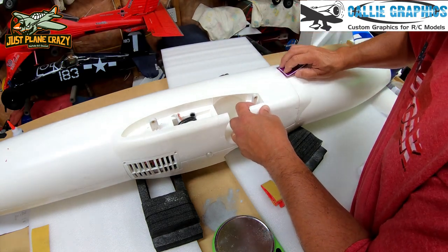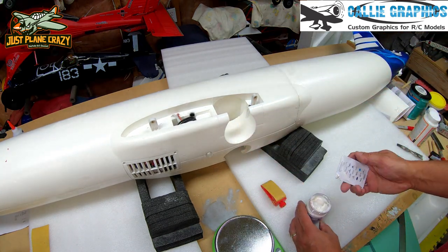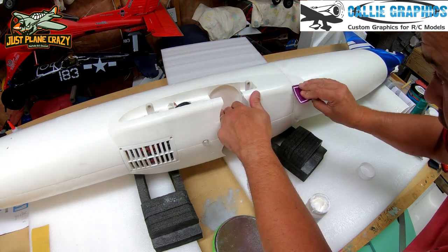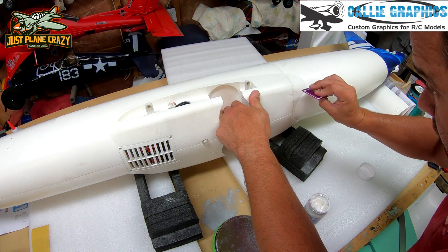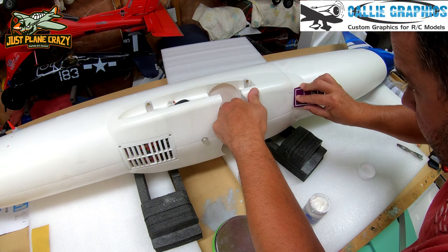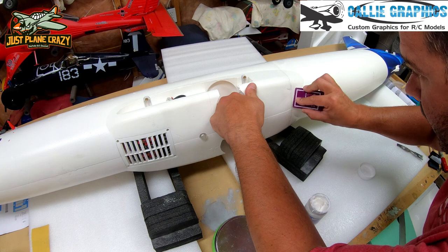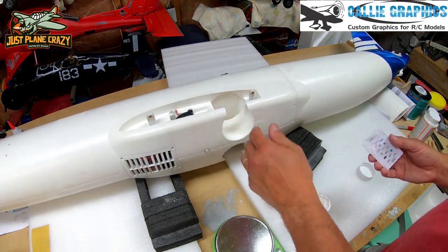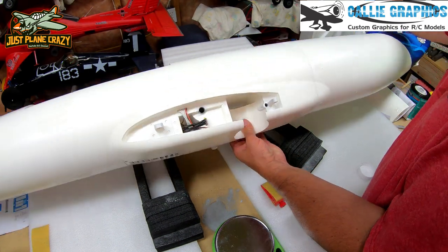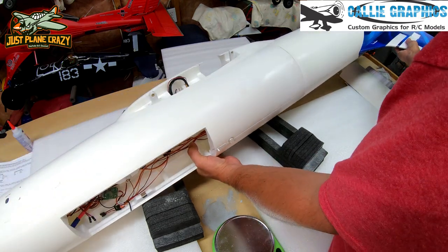So we can really work that stuff way down into that crack and really help to fill it. So I've really found a liking for this stuff. Really just kind of fill that stuff in. And if I have to really close some bigger gaps, by far the spackle works better on the bigger stuff. But for these deep channels like this, this acrylic medium is perfect.